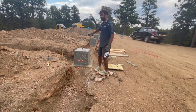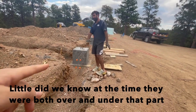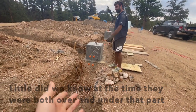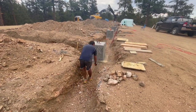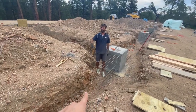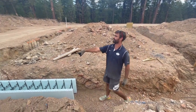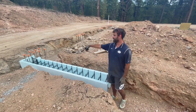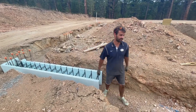That's not so difficult. But then you have to fish the other rebars, and we don't know where they're gonna line up - are they under that block or over that block? Are they at the same height? We will know once we put one of those there. So we need one more piece - or two more. You need to end at a certain spot, and if you can stay in eight-foot segments the whole way, you'll have the least amount of joints. We need to secure that joint, especially with only two rows.